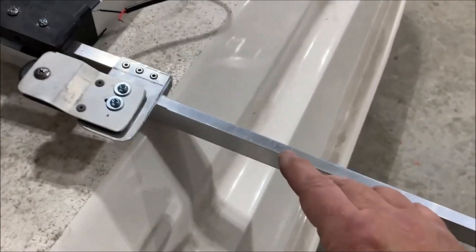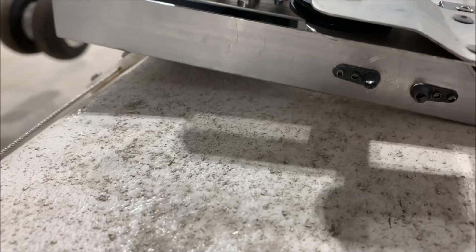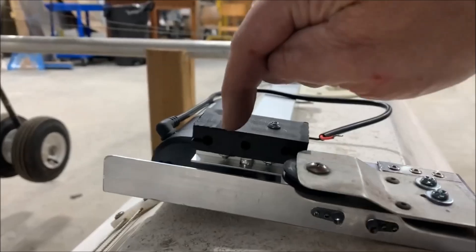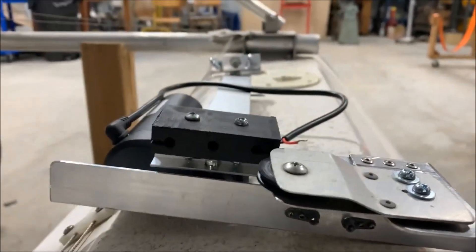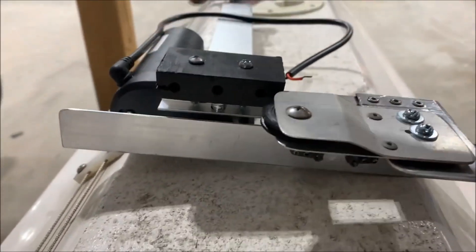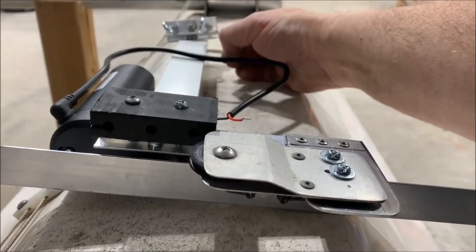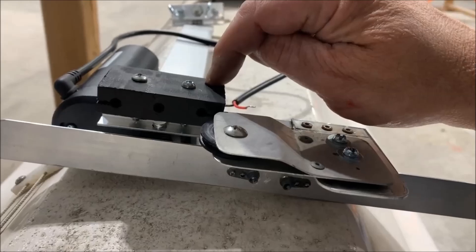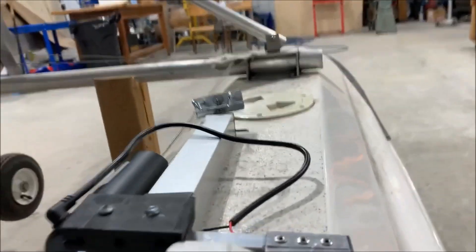The back piece over here — let's see if I can get better detail. This is just angle aluminum. The three holes over here are going to be for the lines going in. The cables for the main landing gear are going to be coming in through these two holes here and going to these eye holes. The nose gear cable comes from the front. I still have to make another little bracket just to hold the cable here — it's not going to be braced. Then the inner cable will go free air through this pulley and through this hole over here. That'll be attached down lower. The reason for the pulley is because if you recall when I was doing this originally, trying to yank on that nose gear — especially with a 90-degree curve in these cables.